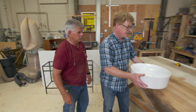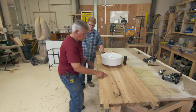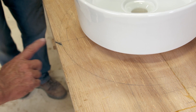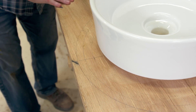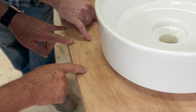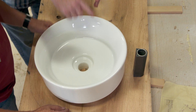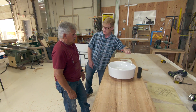So I see you've got some of this laid out. It looks like this is the width of the countertop right here. I see you've got a couple of different layout lines here — just trying some different things. Yeah, I was just playing with what was the right amount of overhang for this beam relative to the sink. So have you decided which one you're going to do? It's the second one in. So we're going to cut this line across here, then go straight over and cut the length. And then we're going to need to cut a four-inch hole for this bowl to sit down, and then a hole for the faucet.